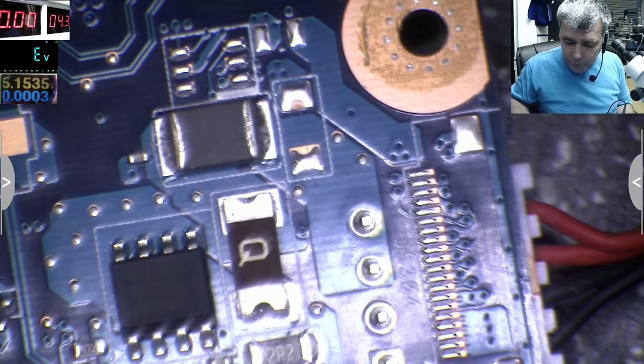Or what we can do more, because it's supposed to be voltage there. So we took the bridge and we have no voltage. Yeah. We can short the gate with the input and it will be the same result. You can see on the multimeter 19. So on this one, we just supply the power on the gate, and the MOSFET got open. Or closed, you know what I mean. It's just a wire now. So that's how you diagnose things.